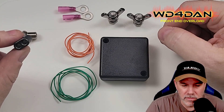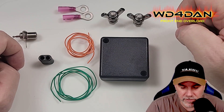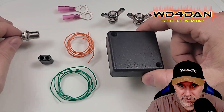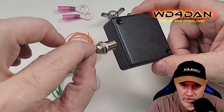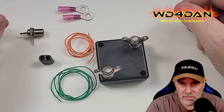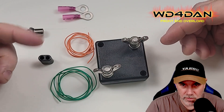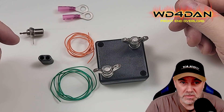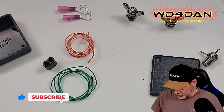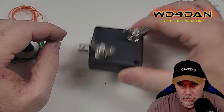Links to this 73-mix binocular core are in the description below. First thing we need to do is drill some holes in the box. I'm thinking the F-connector on the side, and the two wing nuts maybe caddy-corner — because it's a small box, you really can't put them side by side. So maybe caddy-corner on the wing nuts; let's drill some holes and see what we can do.